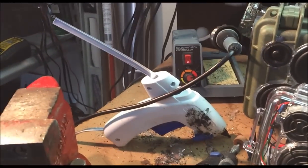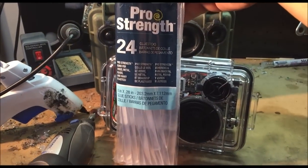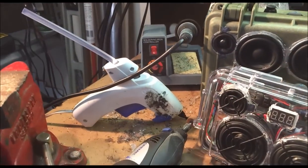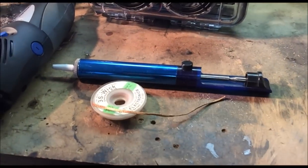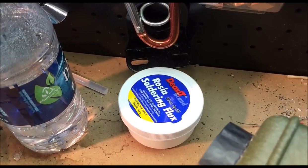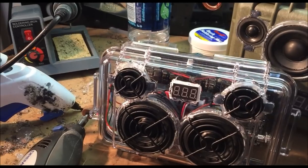I have a decent glue gun — about $5 or $6 at Walmart or Hobby Lobby. There are two types of glue I use: Pro Strength and a standard version. Other soldering supplies that might come in handy include a solder sucker and wicking wire. You'll also need solder flux. It's really important to clean all exposed wiring with isopropyl alcohol before soldering, and then tin each piece — especially the wires and other contact points.